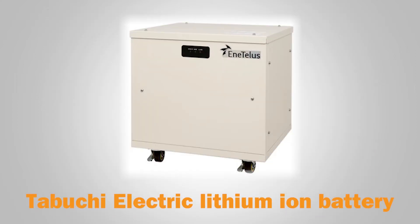If batteries will be unused for the season, some inverters and chargers feature an automatic generator start function for use if panels are covered in snow. If this isn't an option, turn off the inverter and all DC loads while leaving the charge controller on.